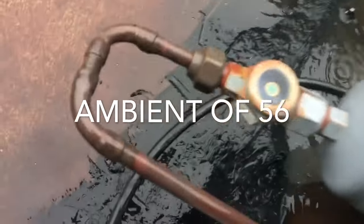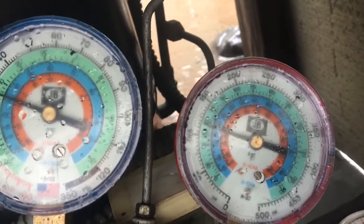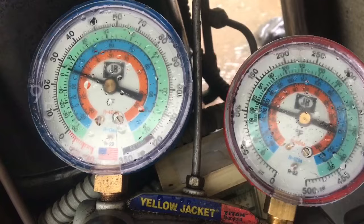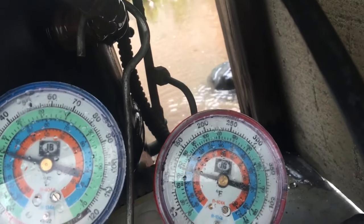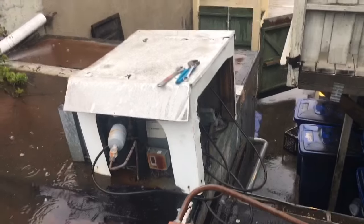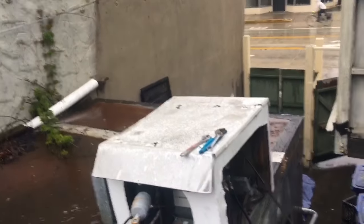This tells us anything about our charge here. Sight glass looks full. And we'll let it run around for a bit here and see what happens. Running. I'm gonna go hook up. I got a probe in the box. I'm gonna hook the DL429 to it for temperature reading. And as the temperature comes down, we'll get into sniffing around what that TXV is doing as far as superheat.